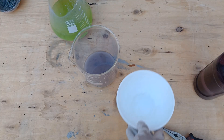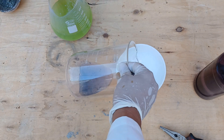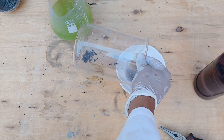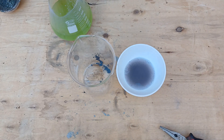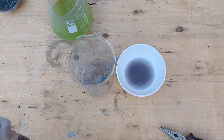Here we will wash the precipitate from the solution, then add nitric acid several times to wash it until only the gold precipitate remains. Then add aqua regia. Aqua regia is a mixture of three parts of hydrochloric acid and one part of nitric acid. It is used for refining of the noble metals.